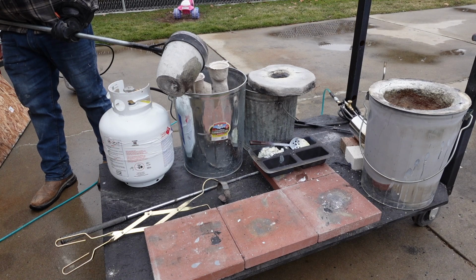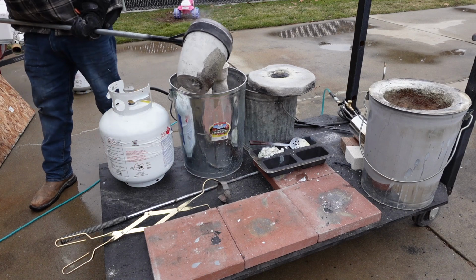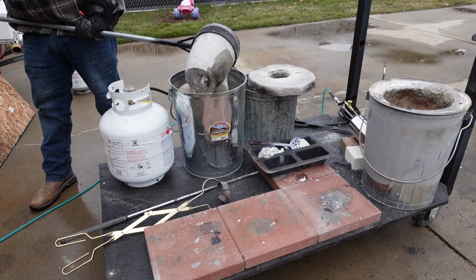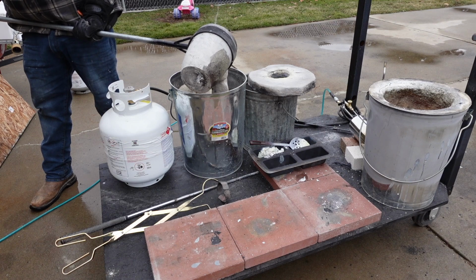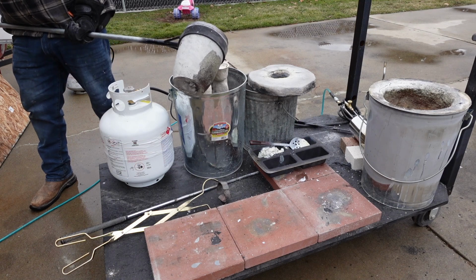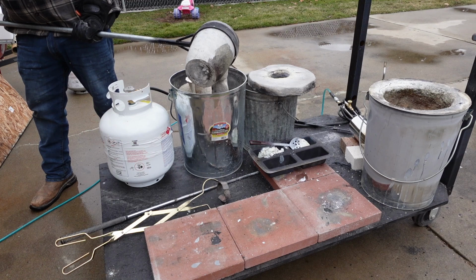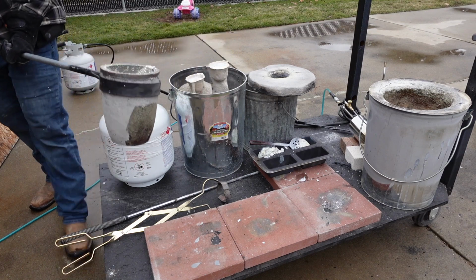and those shells just came out of the kiln and are piping hot, so we know that it'll cast all the way through. This isn't as important with the zinc alloys as it is with a bronze alloy or brass or some others, but it does help to get all of the details, to have your molds warm or even hot.